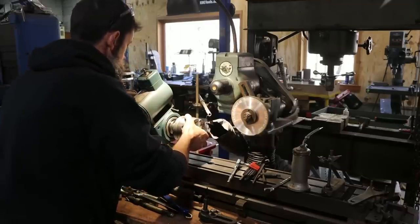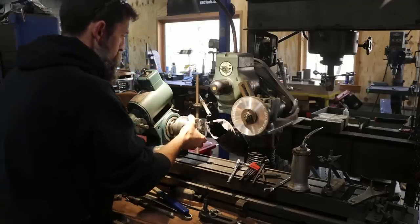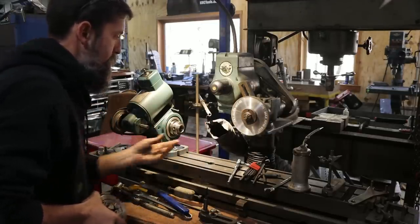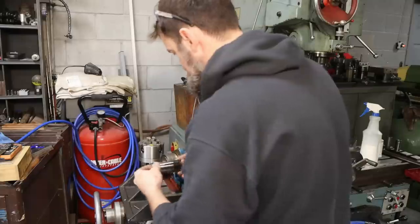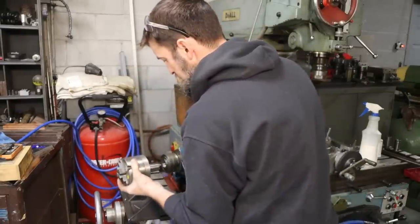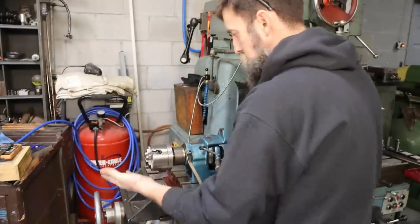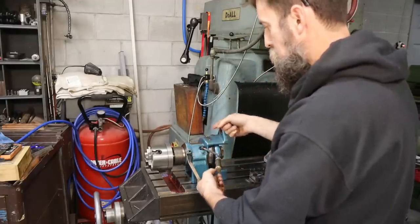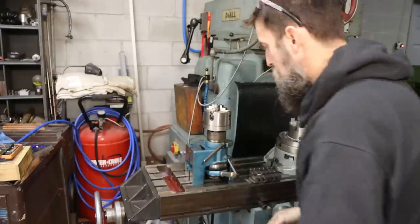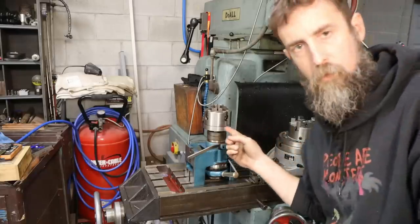On the cutter grinder and the powered work head. Boom. Let me show you something else I can use this on. I need this collet. All right, so I'm kind of stating the obvious here, but anything that accepts 5C, I can now use this four-jaw chuck in. USA horizontal and vertical indexer. Nice, very nice. There you go, I like that.